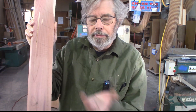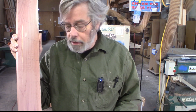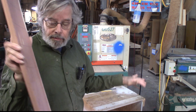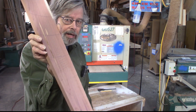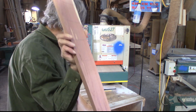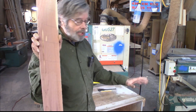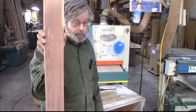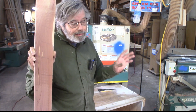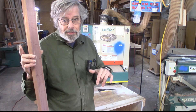It sanded just a little bit. We set it to that and it should hit-and-miss sand — so assuming we had a full stack all run through the planer, we've micro-calibrated it with the real thing and should be able to run all of them through, actually taking another hundredth off from what you see here. That is a case-by-case thing — if it's wide or a hard wood, you can't take as much off. That's on-the-job experience.